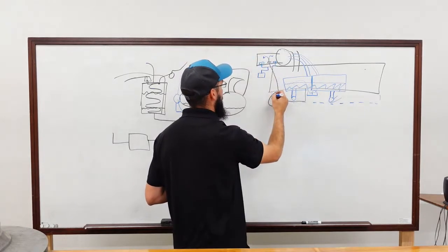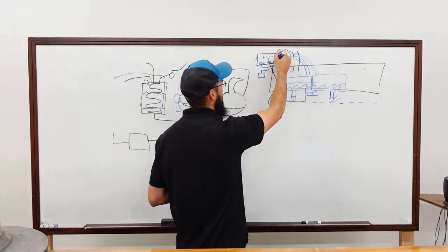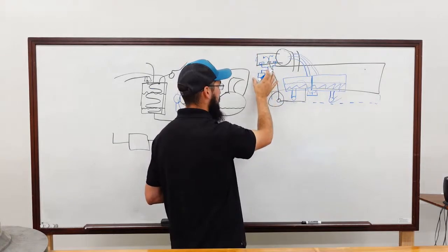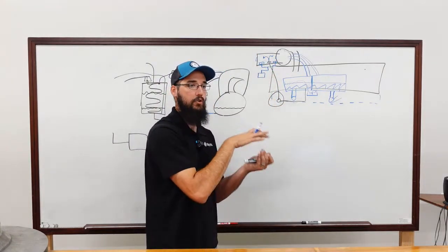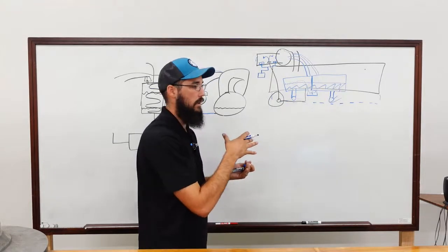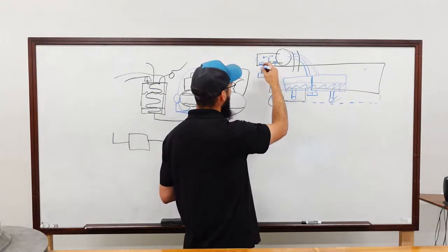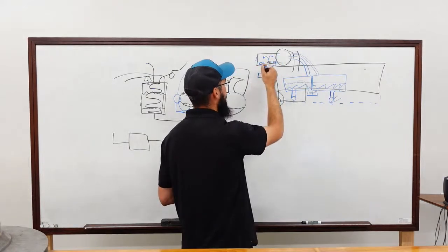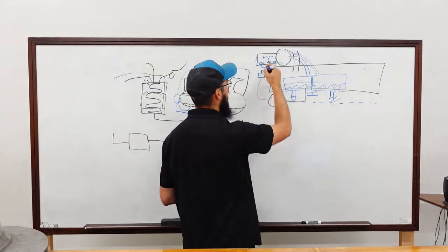Part of your oil system is an oil inlet here for the tail bearing, and then for the inboard bearing, there's another oil inlet. There's several pipes that go into this little accumulator style device on the backside underneath the motor. The purpose of this is so that any oil that gets trapped and pulled through falls to the bottom and then drains back to the oil sump.